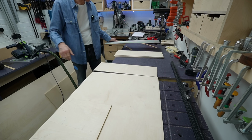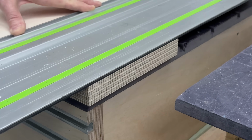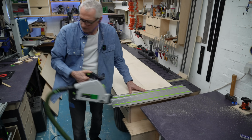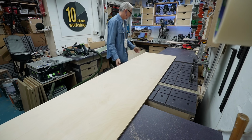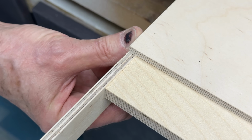And then I can trim them to the right height in one pass. Onto the 12mm liners next, and the cabinets have a 6mm back that's inset, so the liners need to be 6mm narrower than the outers. After cleaning up the end of the sheet of 12mm, I'm using the 6mm offcut as a gauge against our depth measure for this, and then cutting 4 identical strips.